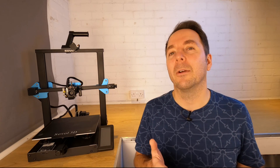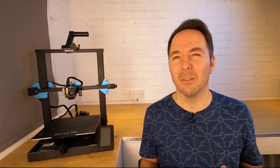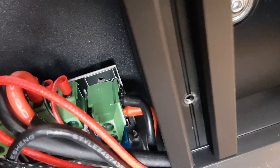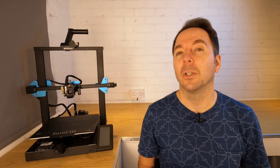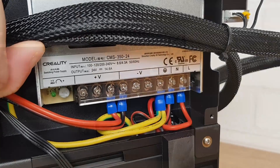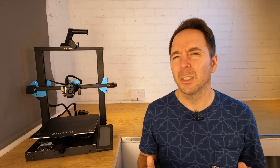I am talking about potential problems I've seen on other similar designs though — the SV01 Pro has given me no issues at all. I could also highlight a couple of other potential areas for issues like the bed wiring looking a little bit fragile and the extruder lever being a bit wobbly, but I really am looking for problems here rather than having any evidence of actual issues. When we look inside the base we can see some nice reassuring signs of intelligent assembly, with ferrules on all wires instead of potentially dangerous soldered wire ends clamped in screw terminals. It's also obvious when we look closer that there's a heavy Creality presence — many of the electronic components are Creality made. What Sovol have done with the SV01 Pro is take some tried and tested Creality components, mix in some of their own clever firmware configuration and cost-saving design, and ended up with a machine that appears to be worth more than the sum of all its parts.